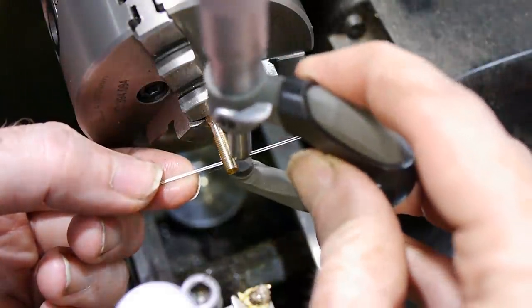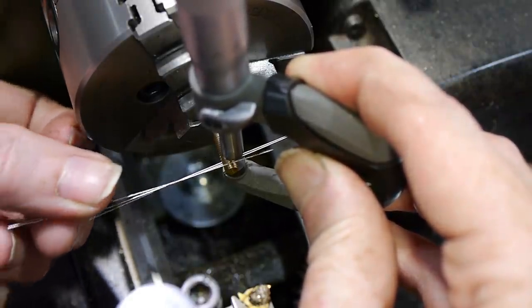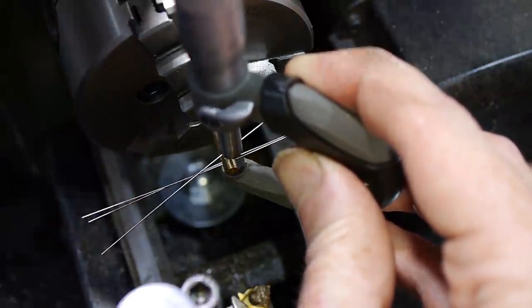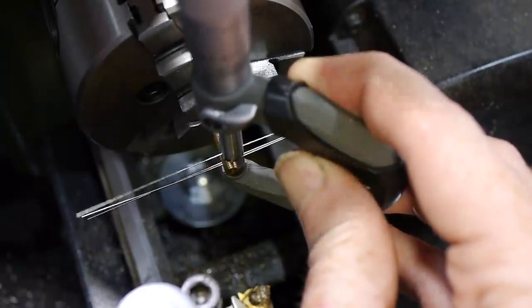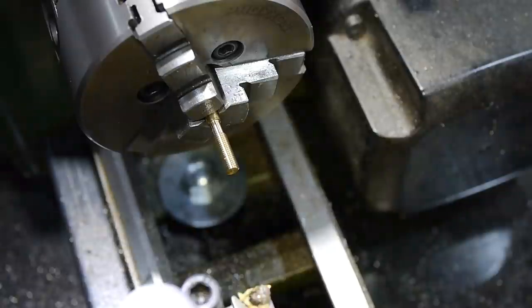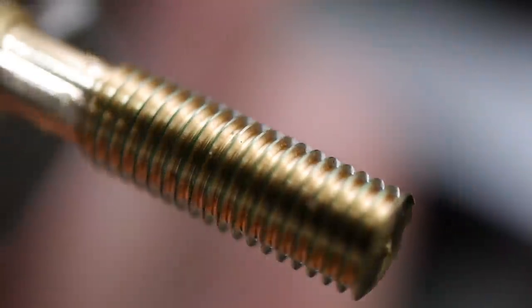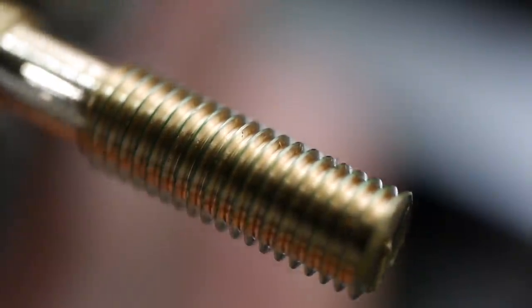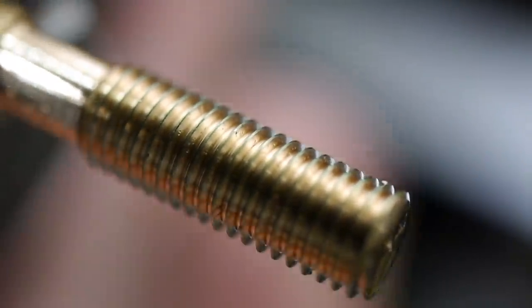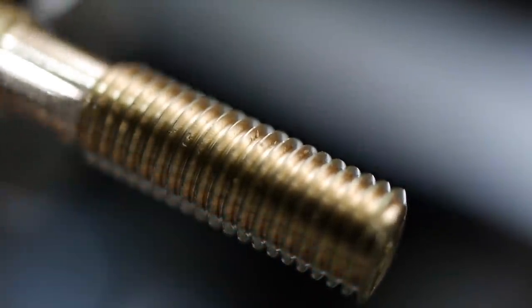Thread wires are a lot cheaper than a set of thread micrometers, and with practice can be used to get very accurate measurements. I got really lucky and was just over-dimensioned on the first measurement. I did another spring pass off camera, which brought the thread really close to the target. The thread looked clean and well formed under magnification, but had a flat point with sharp corners rather than the rounded profile the original has.